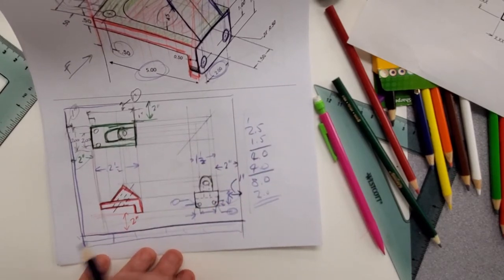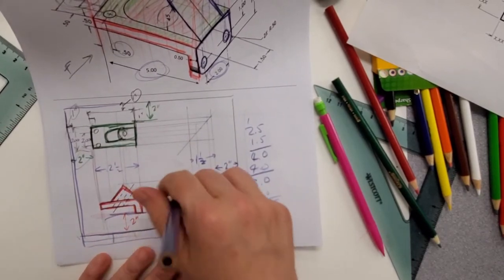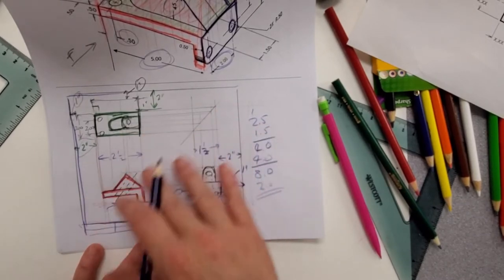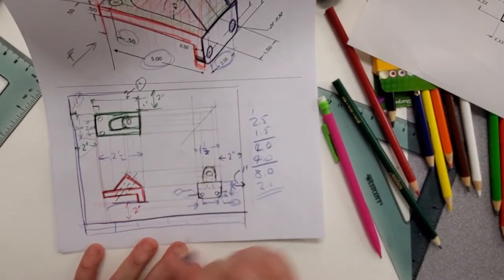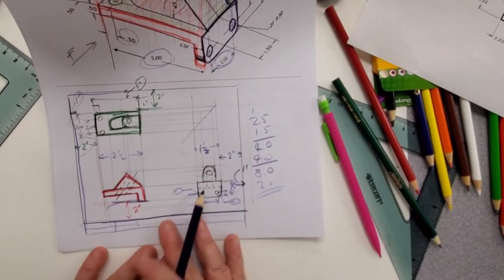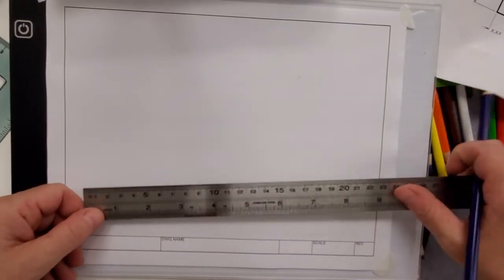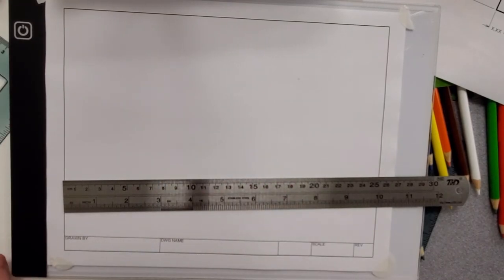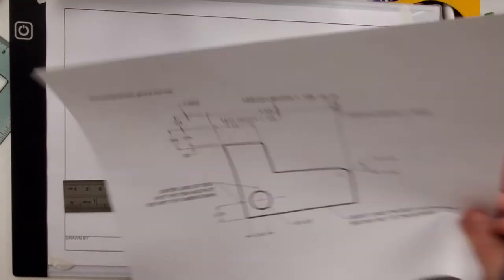Did you notice that? So when you start your part, how do you start? With sketching, like literally hand sketching, this stuff, so that you can assess where you're going to place your views. You can't start here. Because then you're going to be like, I'll start my part 1 inch away from the edge. But then you can't fit your dimensions anymore. Because they can't follow these rules.